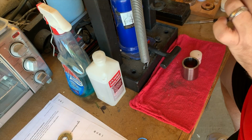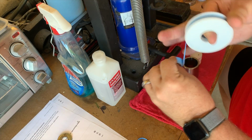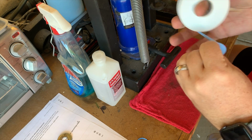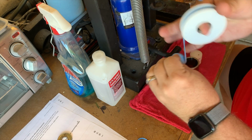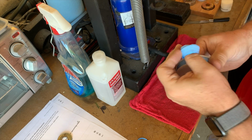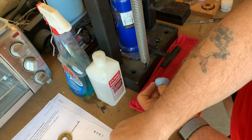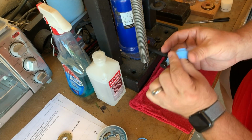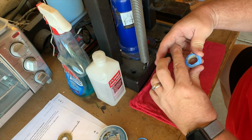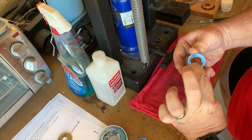As this coin wasn't pushed down through the die very far, I'm going to skip annealing here. But don't forget it completely. It's important that you anneal constantly throughout this process. Again, I'll wrap with the tape, about 7 to 10 wraps. And again, in this case, it's still early on, so I'll pay extra attention to the edge. Clean everything up and fold the tape over the reeded edge.